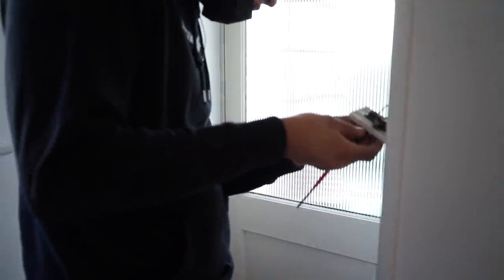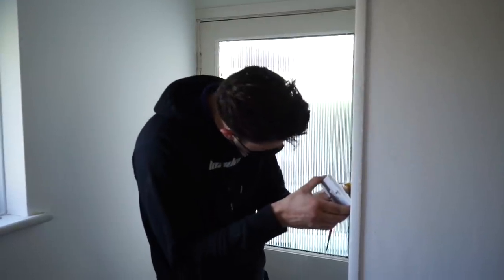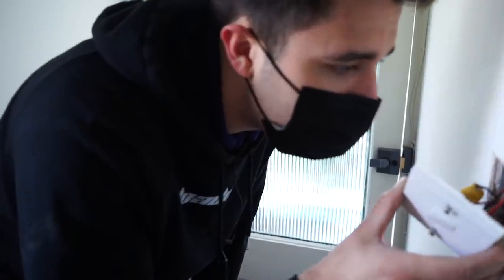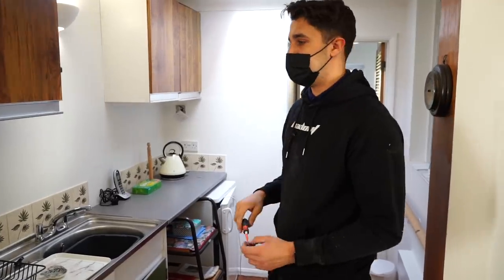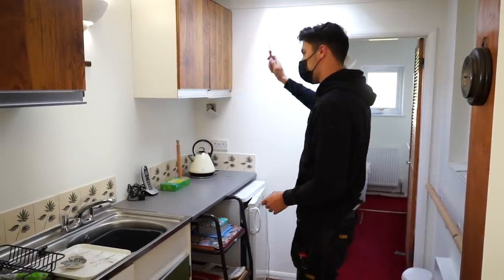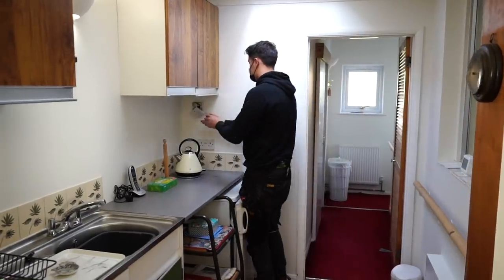Oof. Hey. It's the most bizarre way of doing things that I've possibly ever seen. So you've got the single cables. See, why have they bothered with singles when you've got twin and earth cores that aren't being used? So again, these wall lights here, I found a feed which seems to power those. So we're definitely right in our theory. All of the cables are going back to the board. And all the connections are made at the board. Rather strange way of doing it.